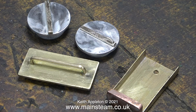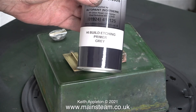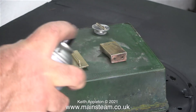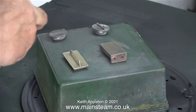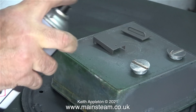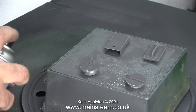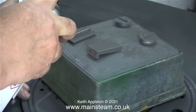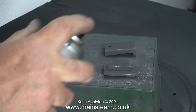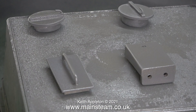To start the painting process I'm going to use the etching primer I always use, which is not really designed for these metals, but it works very well. Thanks to a comment from a viewer suggesting I use my turntable for painting, I now do — thank you very much. I put a plastic box upside down on the turntable so I can turn the parts around and give them a really even coat. And as always, here is a shot of the paint drying. Before applying the top coat, I need to wait 24 hours for the etching primer to thoroughly cure.